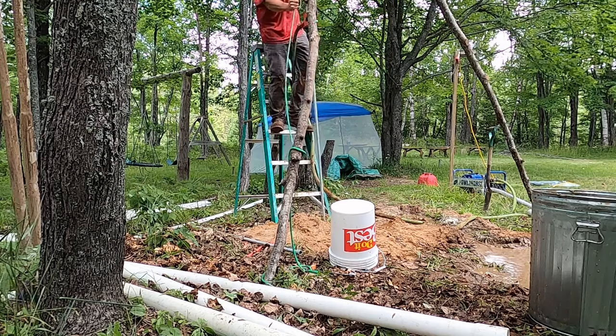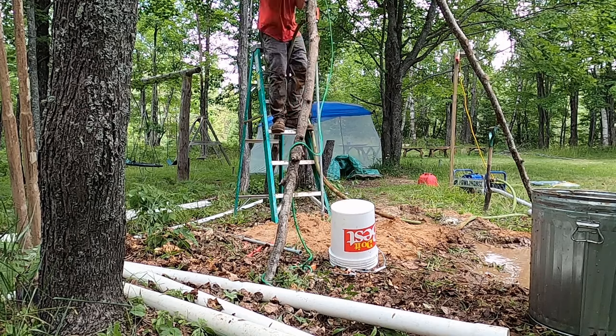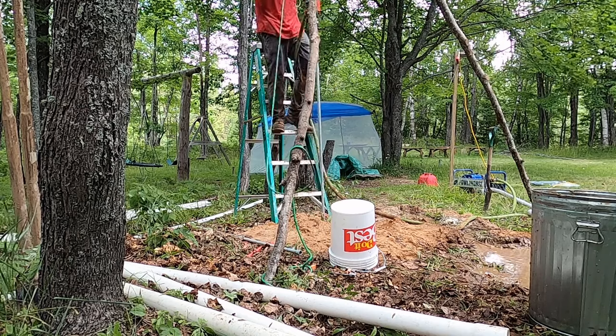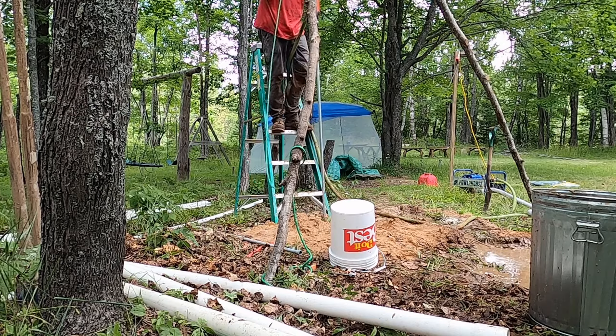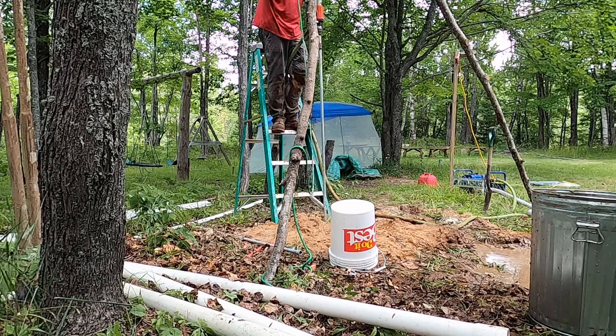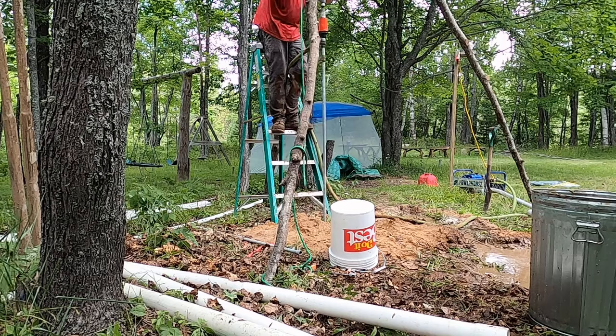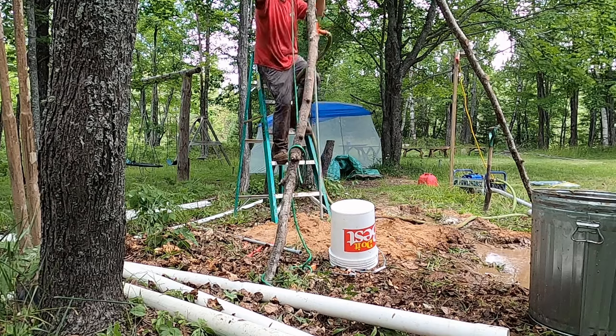So as you're drilling, you have to get the hang of releasing the rope to let the drill rig lower as it goes. It'll actually drill pretty fast. At the beginning here, I wasn't really releasing the rope fast enough, so it was taking longer than it should have.